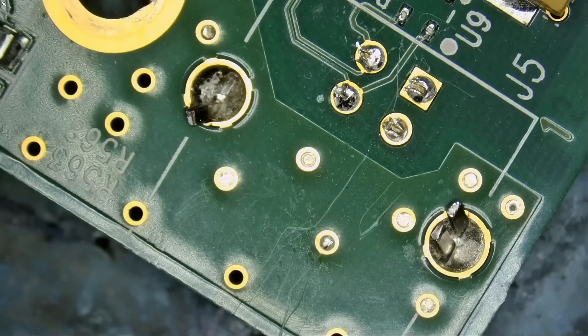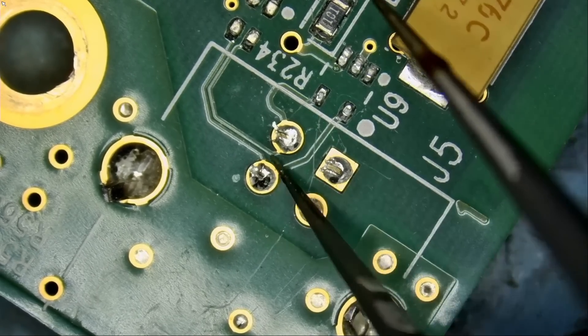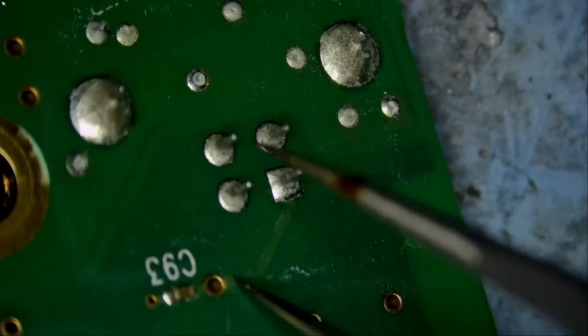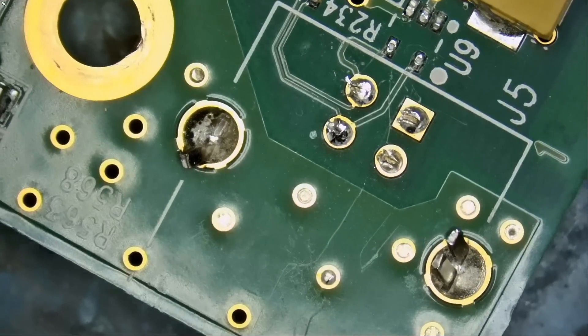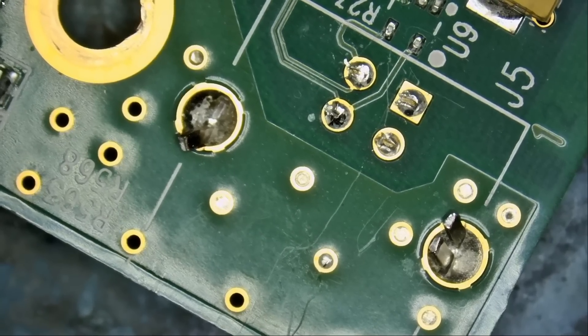We got the board out. That's the board right here and I can tell we have a broken connector. I can see the broken pins — two on the side and four in the middle. You can see the data lines running from this pin, this one, and this one. If we flip the board we can tell there's one here also. What we need to do now is clean the holes — one, two, three, four, five, six.